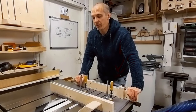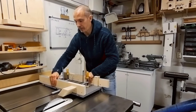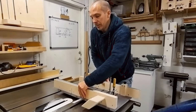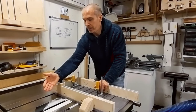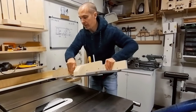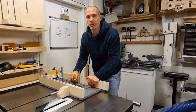This is not the first flip sled in the world. I've also seen other designs where you move the sled to the other miter channel to make the 45-degree bevel cuts. Compared to moving it to the other channel, I prefer to flip the sled instead. The main reason is that the miter channels can differ slightly in width, and if you make it zero free play in one channel and then move the sled to the other, it might get stuck or you might have excessive free play.